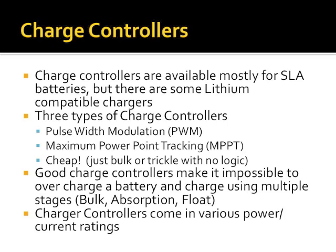If the battery is nearly dead, there's bulk charge, which is get the energy level up fast. Absorption covers usually the last 20% of your state of charge, but it also uses a higher current mode to help desulfate battery plates inside the battery, which is important, but I haven't really gone into. And then finally, what you guys know as a trickle or a float charge to make sure your battery stays charged.